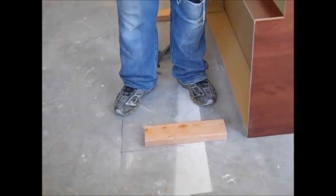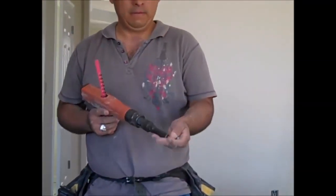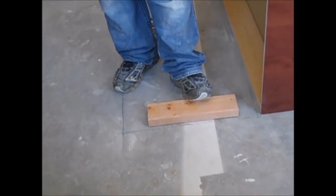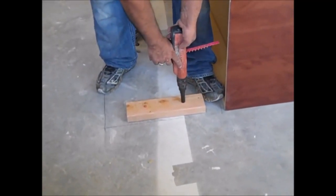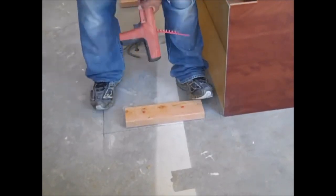That's a step that he could have done, but it might be that he just found a scrap piece of 2x4 out in the garbage that wasn't long enough. So he's just going to shoot that, and he backs off the line that he drew, the thickness of the side of the cabinet, because the cabinet has to actually fall right on top or inside the 2x4.